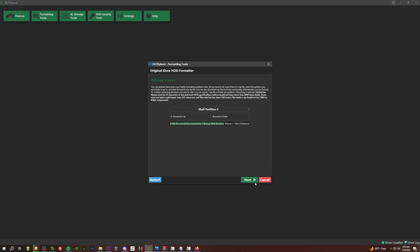Just keep in mind, if you're going to be following along and using the Cerbios tool to customize your BIOS, you do want to mount your C drive later and delete the Cerbios INI. Otherwise, that will take priority. You'll see coming up. But yeah, just throwing this in here. That's how you do that. There's a drop down. You can just plug in the zips. Your hard drive gets set up when it gets formatted.